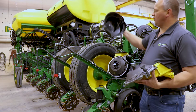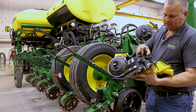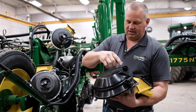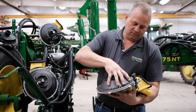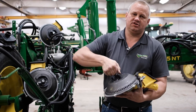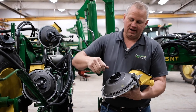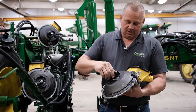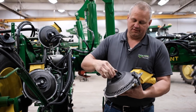When we're planting corn running 15 pounds of vacuum with this vacuum door on there, the vacuum we're sucking creates a suction which actually pulls the meter bowl farther away from the housing, which gives us less rolling resistance. So if we've got very little rolling resistance at this point, we will have even less rolling resistance once we get vacuum on the meter.